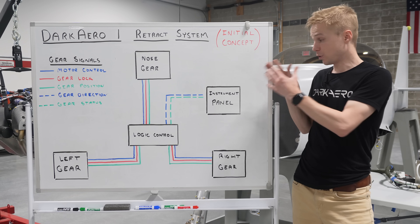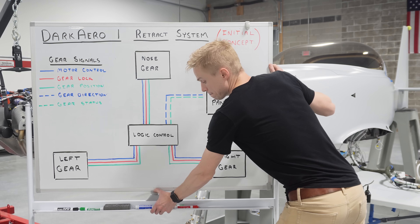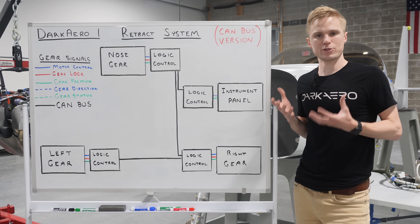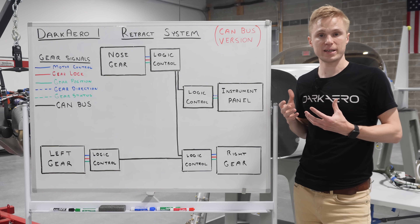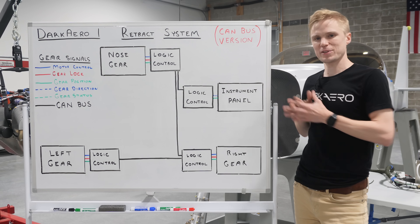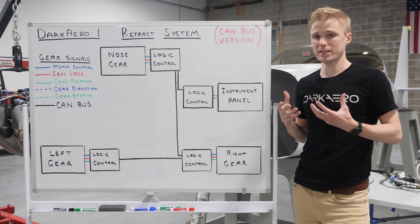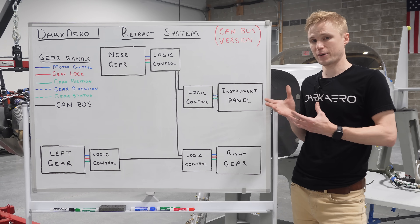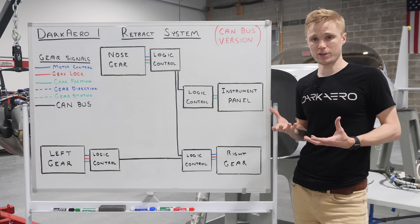On top of this, you also need to relay the up, down, or unknown status of the gear struts back to the pilot. Our approach with the Dark Arrow 1 prototype was to make this gear control network modular by breaking up the central logic board and placing one in the instrument panel and pairing one with each of our gear struts. The result is a system that uses just two wires running throughout the plane, allowing our instrument panel to tell each gear strut when to move and for each gear strut to communicate to the panel what their up, down, or unknown status is. The technical name for this setup is a CAN bus network, which is fairly common within the automotive industry. Outside of needing two-wire CAN bus for communication, each retract module just needs a connection to power and ground. This type of setup will make it easier to upgrade and service our system as the prototype evolves.